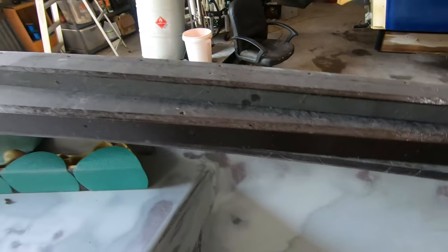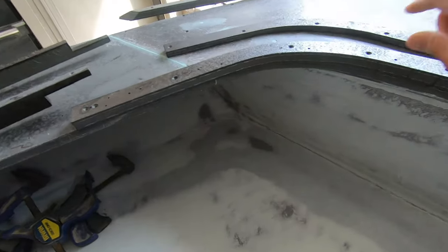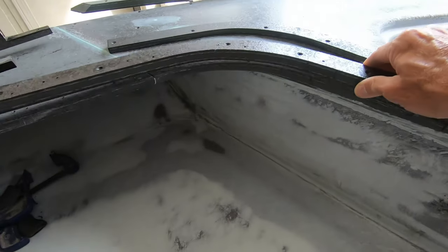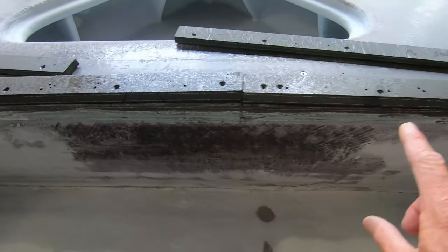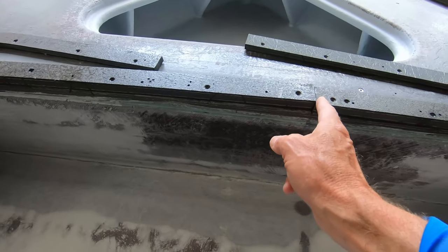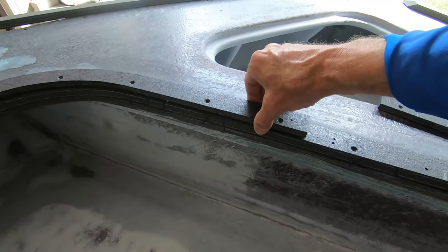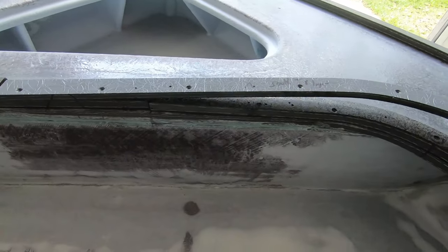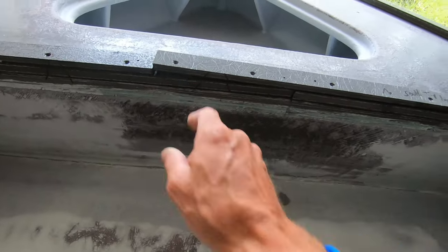We got a little more vertical height to give you a little more to push against. But I wanted to show you guys, we're using one layer of 3/4 and one layer of half. I've already got the pieces cut out and resin coated. But one important thing to remember is that we are staggering the joints. Anytime you're doing two layers of Coosa, you can see the joint for the 3/4 is offset, and then for the half inch layer, it's offset the other way. And then this layer of half staggers over that, so you don't have seams landing in the same place.